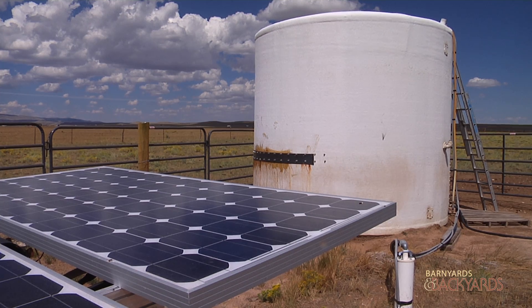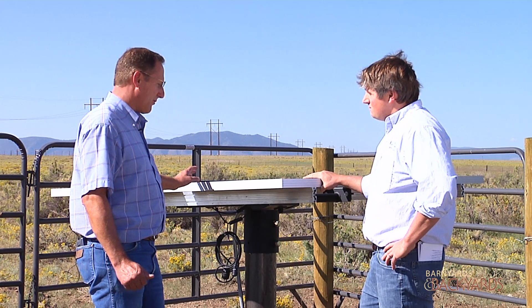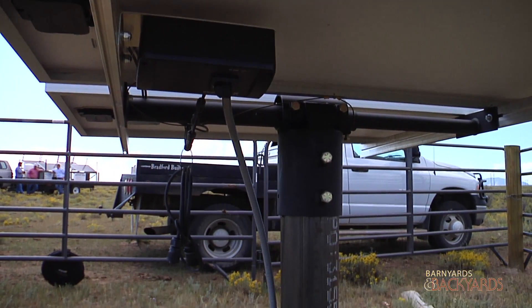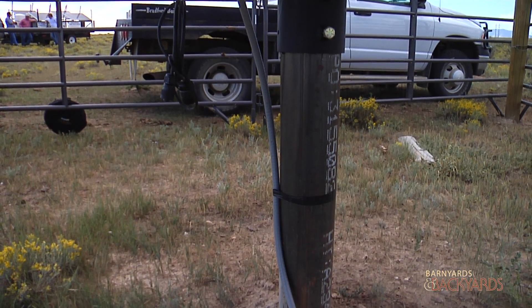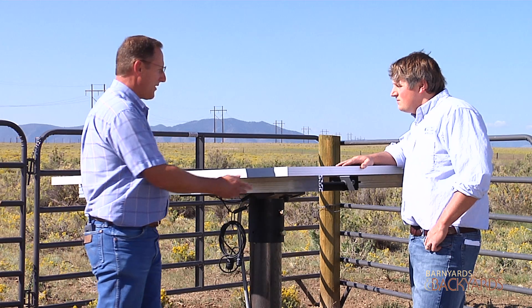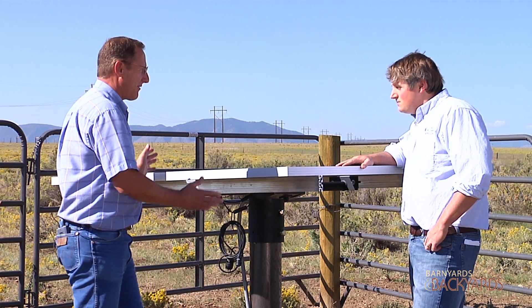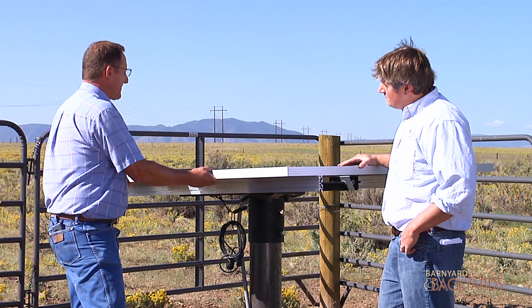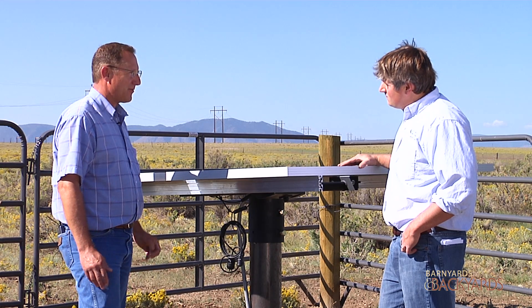The aspects of a good system would be to have good solar panels. These panels should last up to 25 years, and a good setup with your controller so you can run on a generator. You do want to have a proper base. We use a 6-inch steel pipe here, with a pipe welded on the bottom and cemented in, so there's no way the wind can turn any of this system around. You want a substantial rack holder so they don't budge.